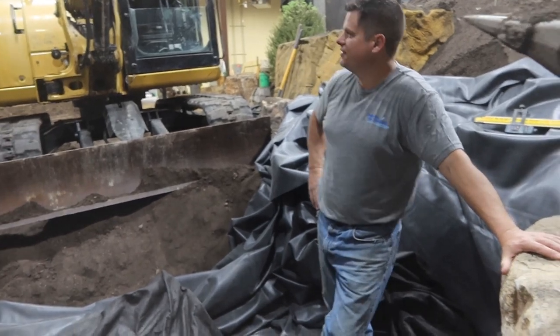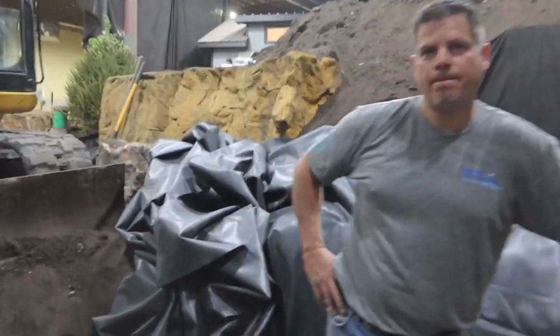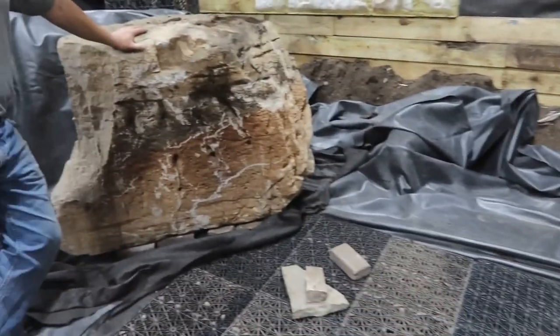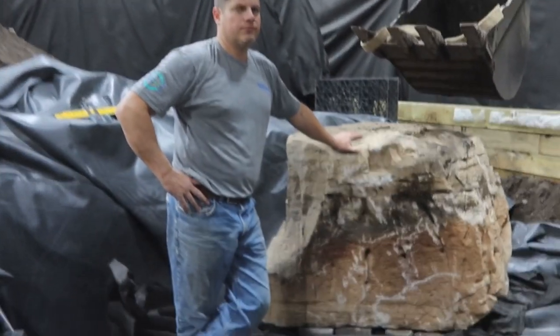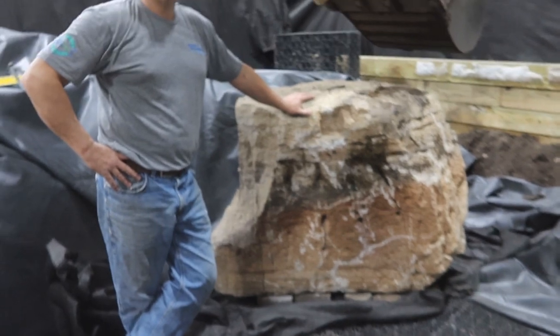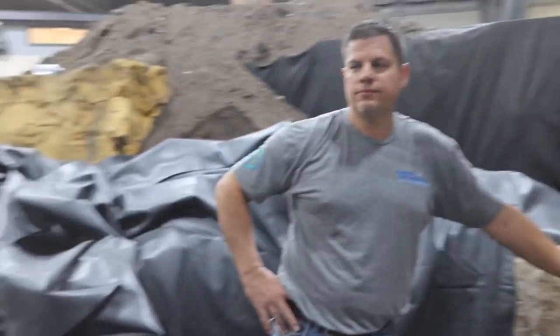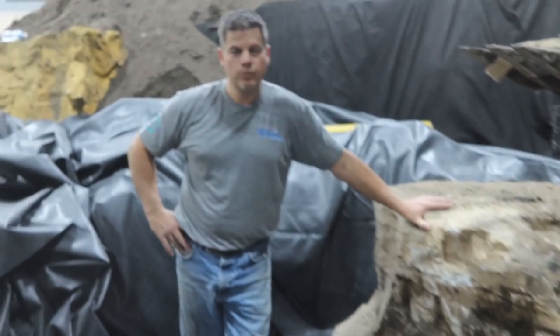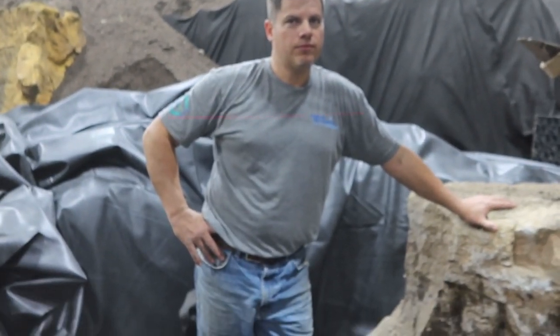So Chris, we were sitting down here talking about the different ways we can actually put this reservoir in. One way was to come in, set a bunch of boulders, then dig out, put our aqua blocks in, and have our liner come up really close to these. The way we chose was a much bigger liner — adds a little more time in preparation — but a much bigger liner that encompasses the entire patio. The biggest advantage is if this big giant pond up here were ever shut off, we can actually flood this whole patio. Sometimes we do that intentionally — like my personal pond — and it becomes my kid's little baby pool down in this area. We're safer with this in case it ever does shut off.